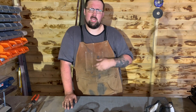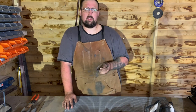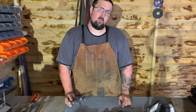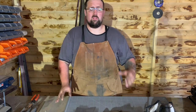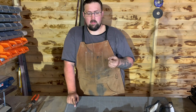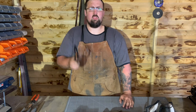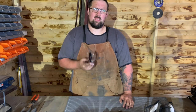The apron is about £15 on Amazon — I'll put a link in the description below. Next thing is safety goggles. I'll be honest, I don't tend to wear these because I wear glasses, but I'm going to get prescription safety goggles. These are essential for when you're grinding and people recommend them for forging too. The last thing you need, especially when grinding, is a cutting disc exploding into your eyes — sparks can really, really hurt you. A little pair of safety goggles is two or three quid from Amazon or any DIY store.